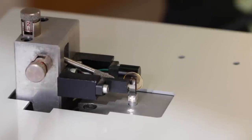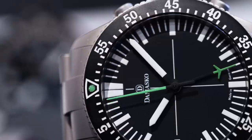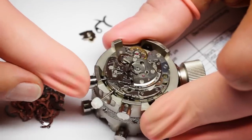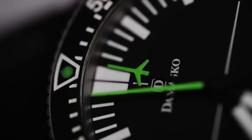In former times you had chronograph calibers like the Lemania 5100 with a central minute counter. We wanted a modern caliber with the same function — a clear minute counter that can be read under extreme situations. The DC-80 is a chronograph with a center minute counter. It's our first step in making our own chronograph movement. The caliber used in the DC-80 is called the DU-51. The base is still the ETA 7750, but about 50% of the parts are changed. In the DC-80 we have a jumping minute hand, so it's clearly visible exactly when one minute is over.